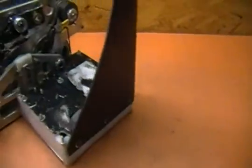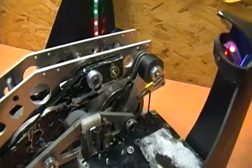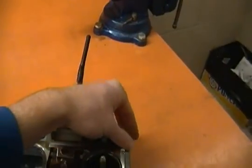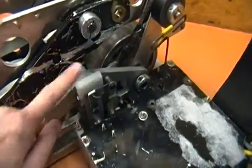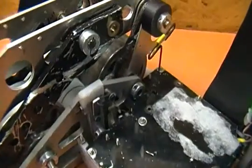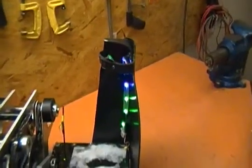While in this mode I can still run the servos manually, so that's a servo reset after 0 throttle for 3 seconds. Here I can flip the servo switch, and you can hear them actually resetting. Do it again here. And that's how I can test the system in the pits now, and play with my cool little LEDs.